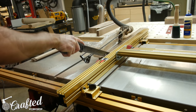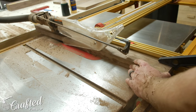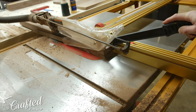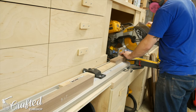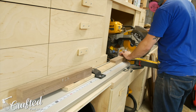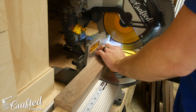You can probably see all the dust being blasted back at me — it turns out the blade guard, which has dust collection built in, had gotten clogged with a piece of bark that broke off. This is why I always wear a respirator even with a good dust collection system. After squaring up the face at the table saw, I squared up the last face at the planer. I cut the pieces to their final length at the miter saw, and then it was time to start laying out the joinery.